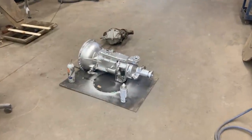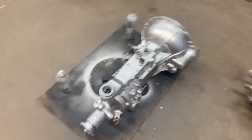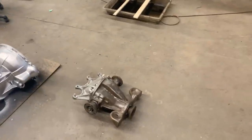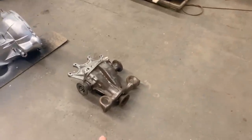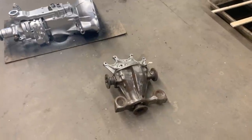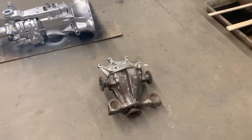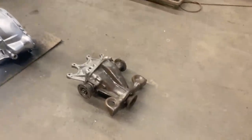This is KJ — he's taking care of the exhaust, priming it, and he's going to paint it with a flat black ceramic paint. He's been painting parts here and taking care of everything for me, even the transmission with our A-type overdrive that we rebuilt a few years ago. He wants to paint the differential too, but I put it on hold because I wanted to change the seals first. So that's what we should do before the rear suspension — replace the seals, then he can finish painting it.